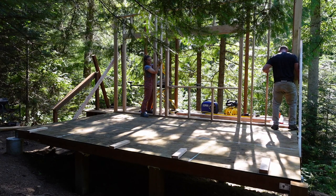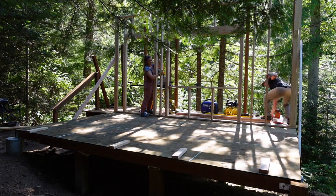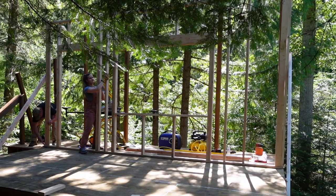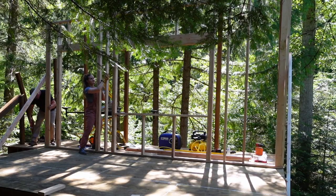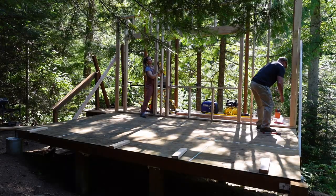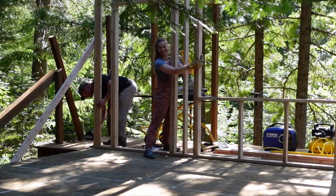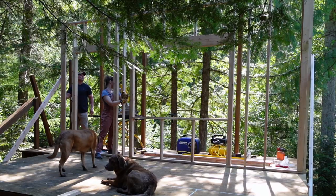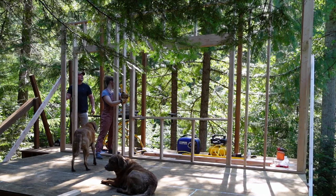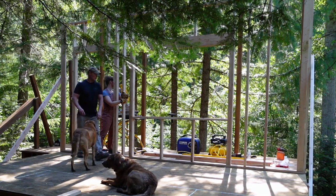I'm going to walk my side. I'm going to grab my hammer. This is so exciting. Look how tall that is — this is awesome. Check level and plumb on this side, and then I'm going to put screws in to hold it in place where it's level.